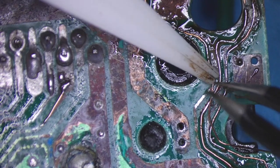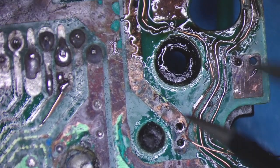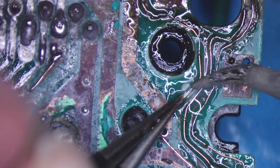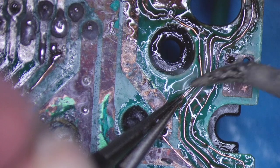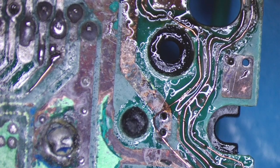In this section of the video I'm repairing three trace wires from the headphone connection. The Game Boy speaker is faulty so it's important that I repair these traces so I can use an external speaker to test that the sound is working correctly.